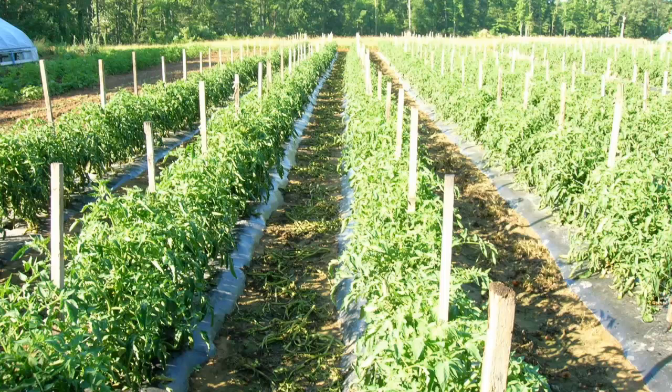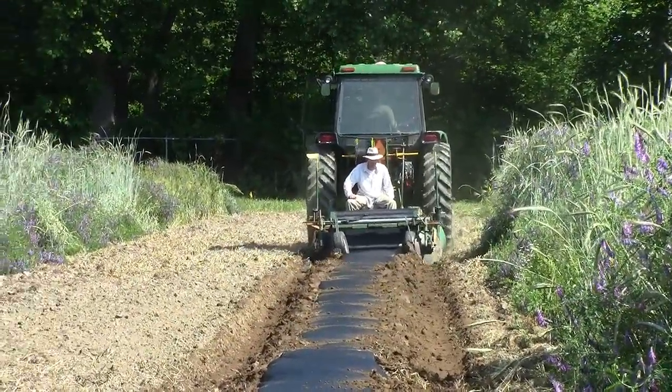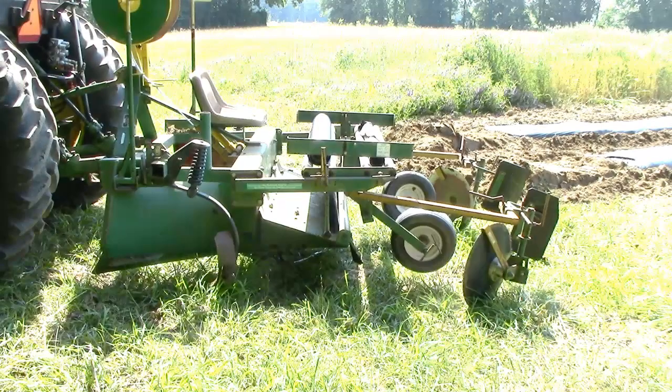The drip line is installed with the plastic layer, or it can be pulled by hand on crops without mulch. Next, let's take a quick look at how plastic mulch and drip tape is installed. Laying plastic mulch correctly takes time and proper equipment adjustment — you should plan on practicing to get things right. In this example, we are using a 6 to 8 inch raised bed system. It takes a tractor with significant horsepower to create a raised bed and carry the heavy machine. Typically, a 50 to 60 horsepower machine is the minimum.